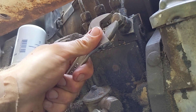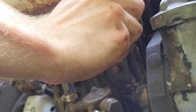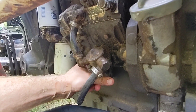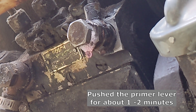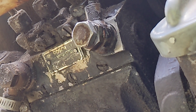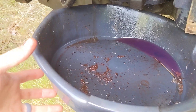I didn't bring all my metric wrenches, so I'm not sure exactly what size this is — somewhere between 11/16ths and 5/8ths, whatever metric size that is — but I've got my adjustable here. So that is slackened. I read the manual a little bit closer; it said to back this bolt out two to three turns — that was more than I had it the first time. Still got air bubbles. That seems to have gotten most of the air out. There was a lot of hissing and foaming when we first started, barely any at the end. It seems like a lot, but I'd guess we only got a couple of ounces of fuel in the pan, and that includes what came out of the filter when I took it off. That's nice and snug.